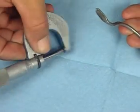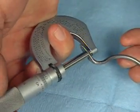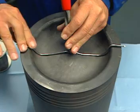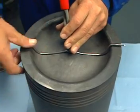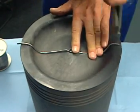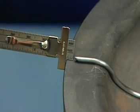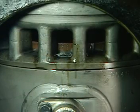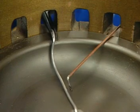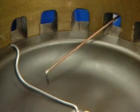To provide the necessary information to evaluate the amount of subsequent wear or change in head-to-piston relationship, a lead reading must be performed after installing a new power assembly. Using a sufficient length of 1/8 inch lead wire, EMD part number 8243661, form it to the same contours of a piston of the same diameter as the cylinder being checked. Make sure that the lead wire is cut so that the ends of the wire are at least 1/8 inch or 3.18 millimeters from the outside diameter of the piston. Bar the engine over until the cylinder being checked is at bottom dead center. Using needle nose pliers, insert the formed lead onto the top of the piston being checked through the liner ports, and position the lead so that it is parallel with the crankshaft.